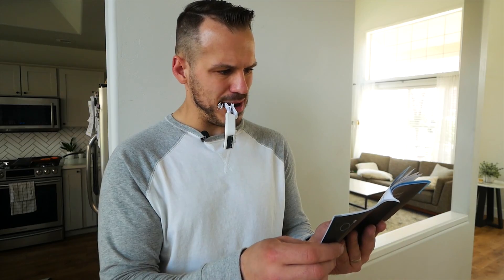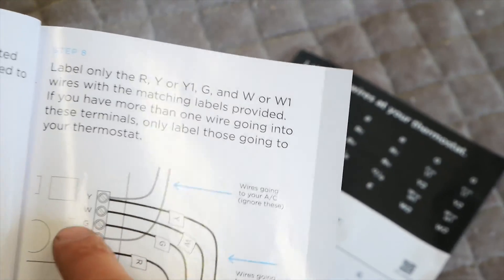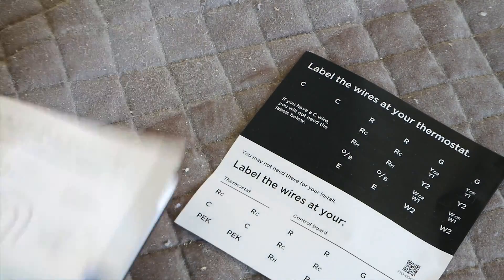There it is. Have you completed steps one, two, four? Yes. Power extender kit — right here. Take your power extender kit, wire lock labels, tools, and go to your HVAC system to reveal the control board. Take a picture of the wires connected. Label your wires. Disconnect the wires labeled Y, G, W from the control board. Connect your wires to the power extender kit. These stickers label the wires that are coming out of the furnace already, so let's find them and put stickers on whichever one is which.